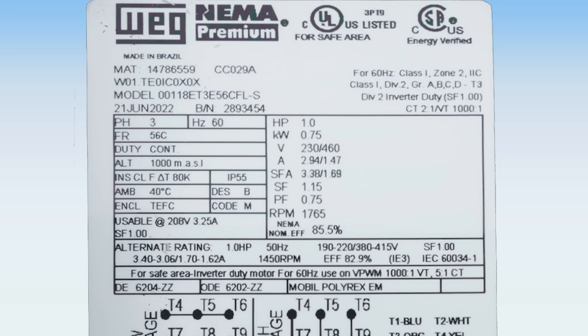Let's get into what is likely the most important data to most people on the nameplate. We can see this motor was designed for 60 hertz three-phase operation. Then there's horsepower, operating voltage and current. It's fairly typical for three-phase motors to operate at either 230 or 460 volts, and single-phase motors at 120 or 240 volts.